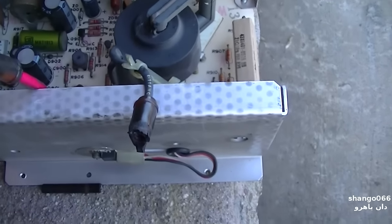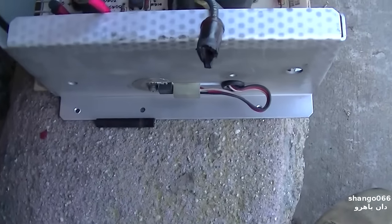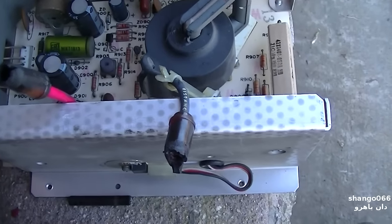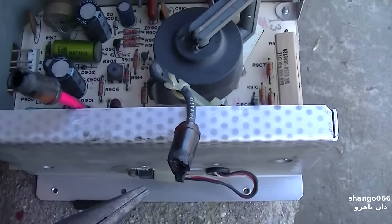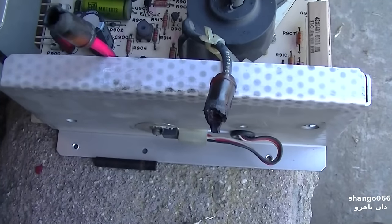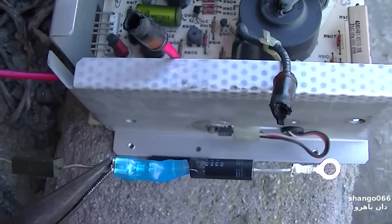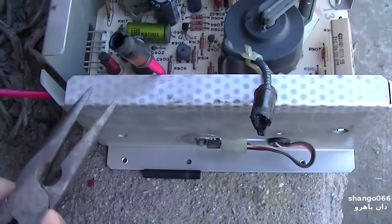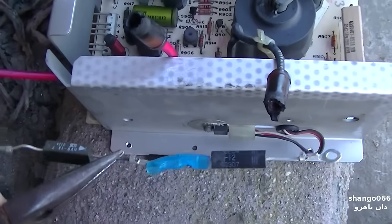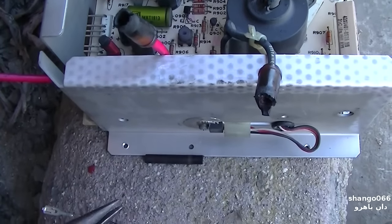So the question is how to replace this. Today I'm going to do a really dangerous crude experiment. The reason why I want to do an experiment is solid-state stuff is not like tube stuff - this can't arc and burn, it'll burn up the transistor or maybe the flyback. These are microwave oven diodes rated at about 12 kilovolts; this is rated at 22 kilovolts. So I put two of them in series. I don't know if it's valid or not, but it can't be any worse than what was going on here.